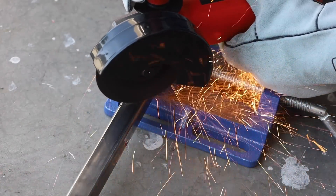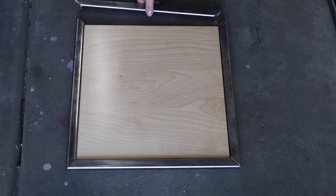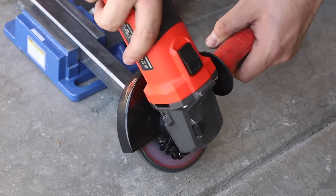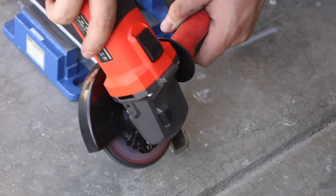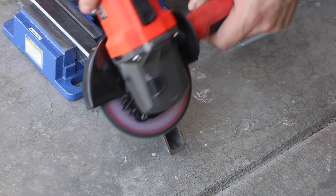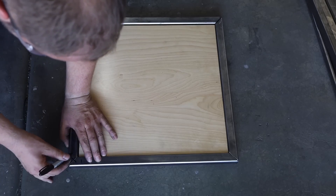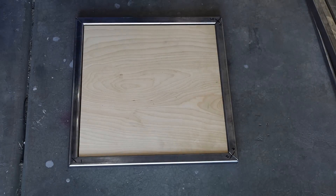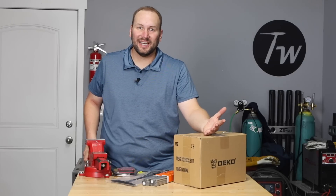I have a real moment of truth here — I don't have enough material to redo this, so I really have one shot. I need to make sure the board fits down inside well. I've lined up all the pieces as a border and put the board in there, and overall it's fitting okay. I can see a few gaps to fill, but I can trim and grind things to fit better. I spend a little time getting things fitted up, then mark each corner so parts don't slip when I go to weld.